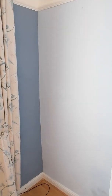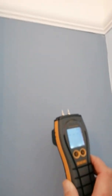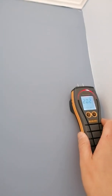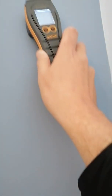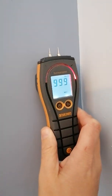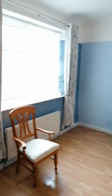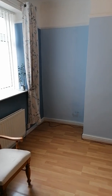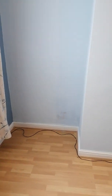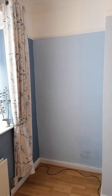It's actually quite simple — the problem is seen it hundreds of times. On the adjacent rear main elevation, again there's a picture rail; coming tight in we're picking up damp at the same spot. We've got this damp patch coming down here. Looking into the right-hand corner of that recess, you can see where the damp patches are — it's coming in a diagonal pattern from the top left-hand underside of the picture rail.